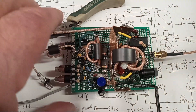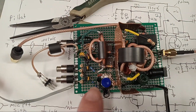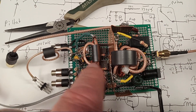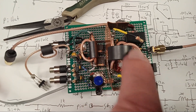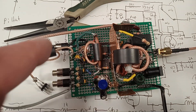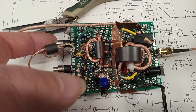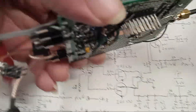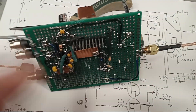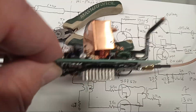Running this at 5 watts, it doesn't get hot and the fan can blow on it. There's a homemade input transformer and a homemade output transformer — it's a lot bigger than it has to be; the ferrite core can be smaller. There's a jack down here for the microphone and the PTT, the other microphone, and the tune button inputs. It connects to the back of the Radio Berry by a 2x10, 20-pin connector — it's all ugly bug style.